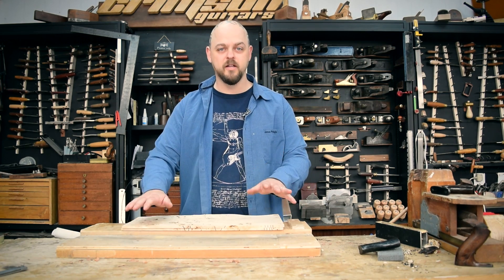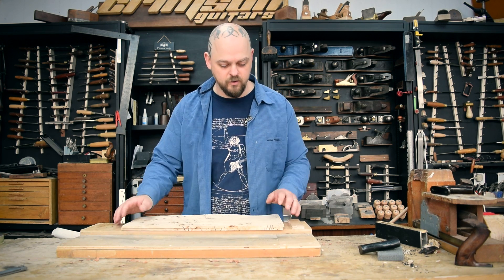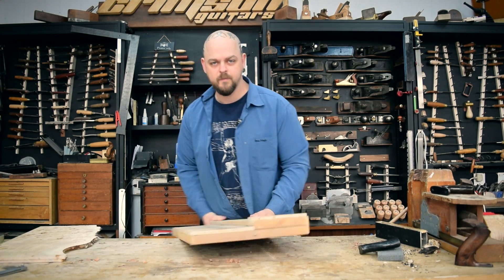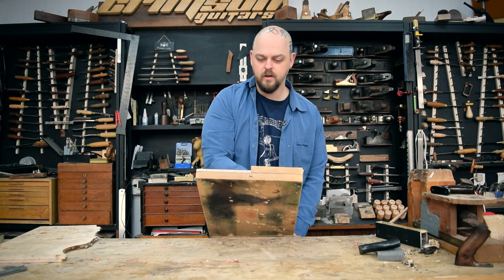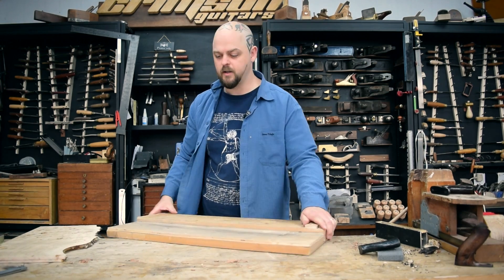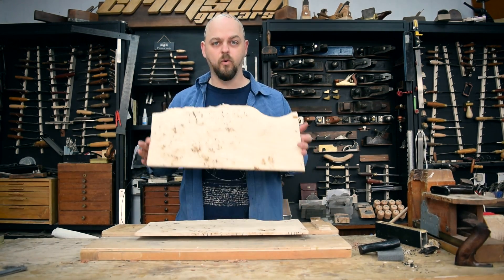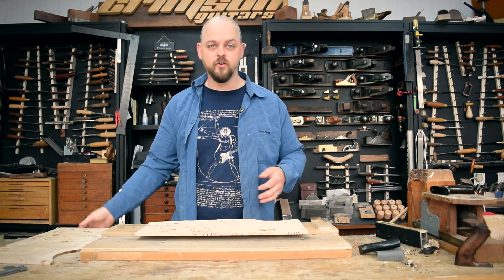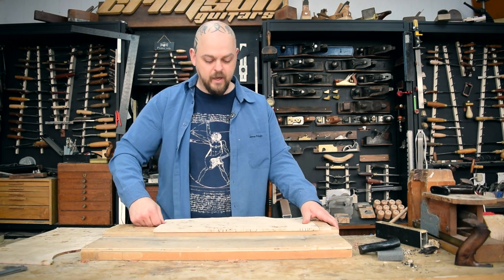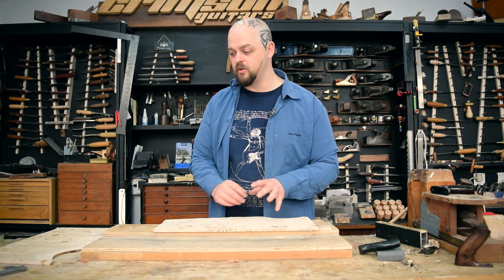The shooting board is a basic device with which to get very good joints on thinner stock — thinner material. Very basically, it is a piece of wood that is nice and flat, another one next to it and a stop. What it means is you can take your guitar top, back, or sides — even more useful for acoustic builders working in two or three millimetres — and it holds up against the stop and your plane is held square to the stock, giving you a nice 90-degree cut.